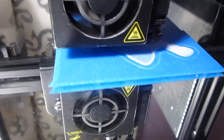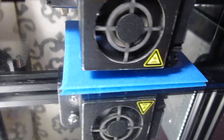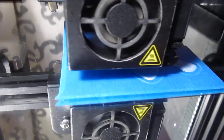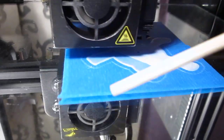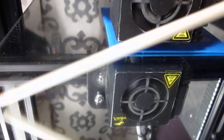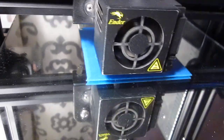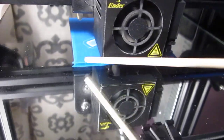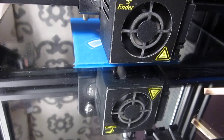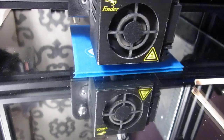We're going to finish up this video, and when it gets almost done I'll post another video. But this is why I use it. When I tram the bed, I don't tram out here at the edges or back corners. The print is only happening right there where you see it, on a flat surface all the way across — right there in the middle. So I'm using the tape for many reasons, but I do have to take into account the thickness of the tape when I tram.